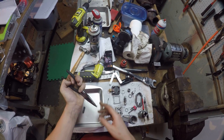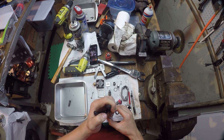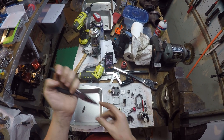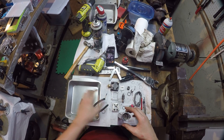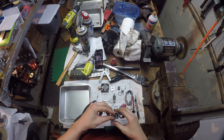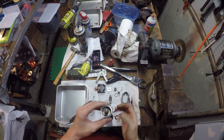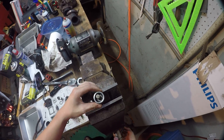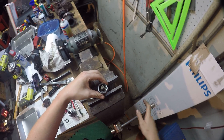Now put your two pins in — one here, one there. Put your plunger in with its spring. You constantly want to check to make sure all these pins are aligned. If the pins are not aligned, you will shear off the pins and potentially ruin your injector.